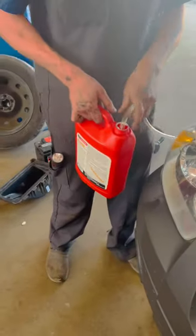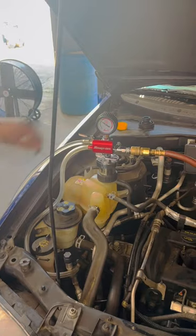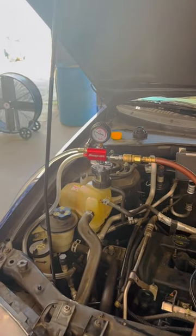We're going to stick it right in our bucket, turn this on, and we're going to suck coolant right up into the engine and fill it. That is the proper way to do it — that's how you need to be doing it on all of these newer vehicles.